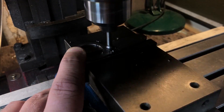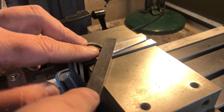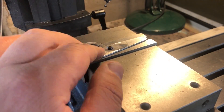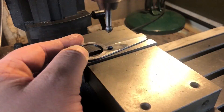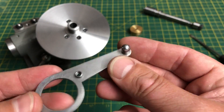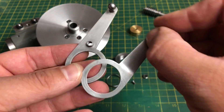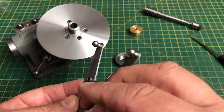Back over at the mill, a quarter inch countersink is formed ten thou or so into the back of the remaining hole. This is to accept the 45 degree feature on the captive nut. With that done we can head over to the bench to see how it all looks. The sector fingers look okay - off camera I have pressed the nut into the sector arm and I have had to fettle the radius on the top arm to allow clearance from the clamp piece. Let's get this all together and take stock.